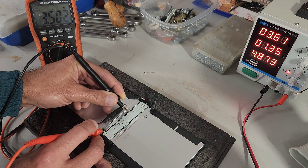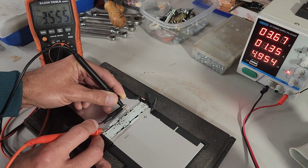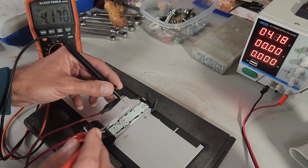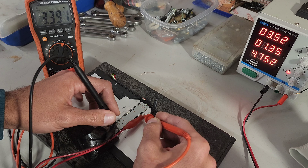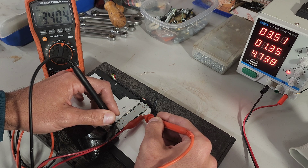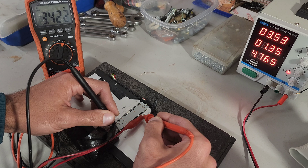You just sit here and do this. I got mine up to 3.8 volts on another battery I bought that had the same issue, and I just put it in the computer and now it's charging like normal — up to about 20%, with about an hour to full. Basically, you just have to get these cells higher than the 0% mark, or else the charge controller won't even register them and won't try to charge the batteries.